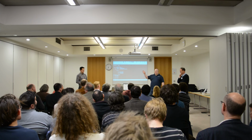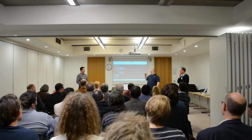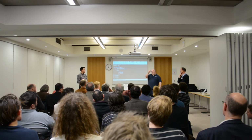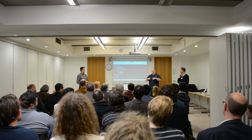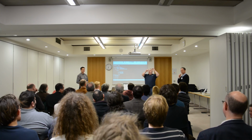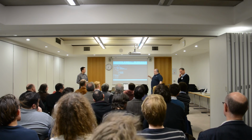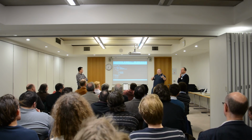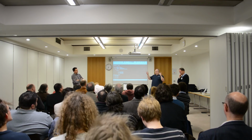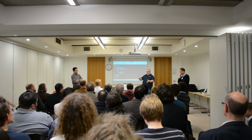an original swipe type card called a Wiegand card, which is even older. Yeah, it's all done in hardware, basically. Wiegand cards had tiny little bits of paramagnetic wire in them, and literally in 2 rows. So you could hold a Wiegand card up to the light, and you can read the bit stream. If it's on the top, it's a 0. If it's on the bottom, it's a 1. So that technology, they've just changed the delivery. That Wiegand code, the 26 bits which is 24 bits with a parity at either end, has just gone to a different format.